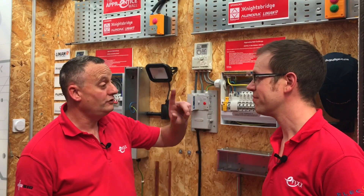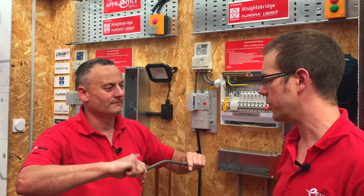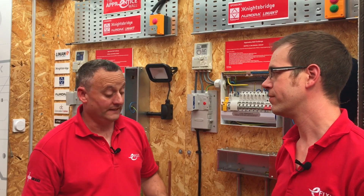Having both had a chance to install one of these 19-core 25mm² tails - it's not convinced it's going to save electricians time, and there isn't a huge amount of time saving to be had. But it is going to save electricians effort - it definitely makes your life easier. There was a lot less effort to install, less difficult bending, less banging knuckles against circuit breakers. In a particularly tight space that's going to be a real gift. Thank you to Doncaster Cables for kindly donating these tails and making us aware of this product.